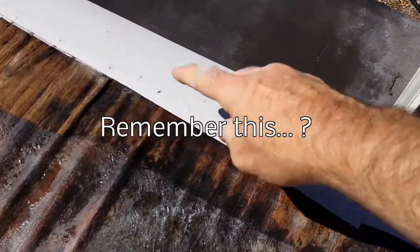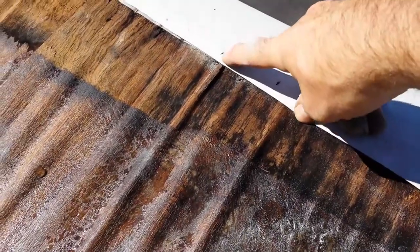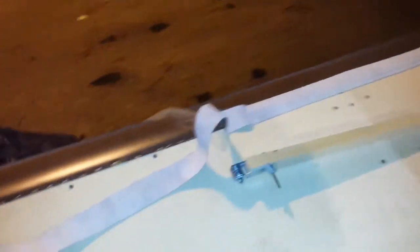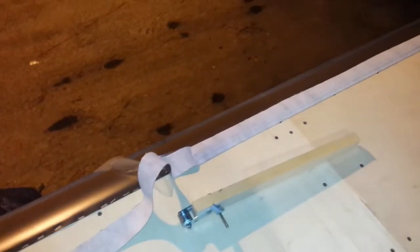It's going to rain tomorrow so I have to cover this all up and get home. To help keep the staples from coming up through the rubber roof — even though it is a liquid rubber roof that I'm applying, which should seal a little differently than sheet rubber — you can see the staples cutting little holes in the rubber roof. So I have a two-inch wide web seal roll from the folks at Eternabond and I'm covering up the staples and the edge of the transition where it meets the roof.